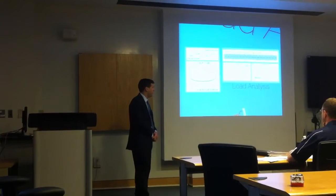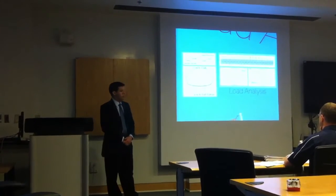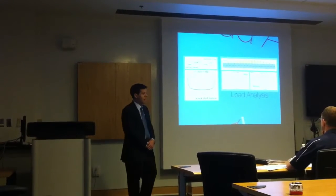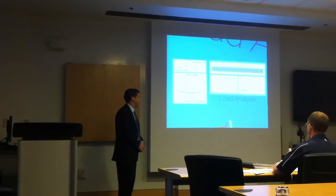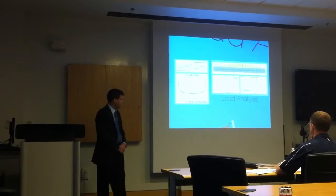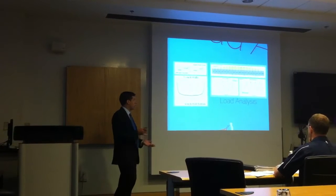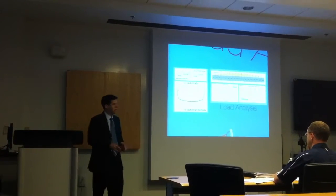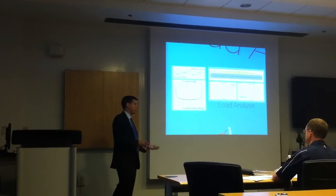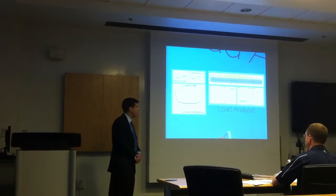counteracting their weight. We designed our reinforcement with basalt mesh, which has similar properties to fiberglass, however, is manufactured in a sustainable manner. We decided to place our scrim on the outer edges of our canoe in order to provide maximum reinforcement through both positive and negative moments.